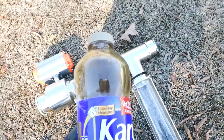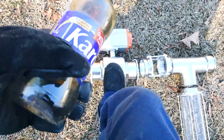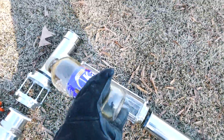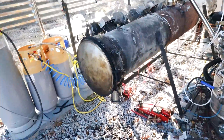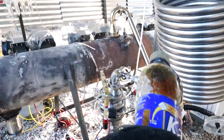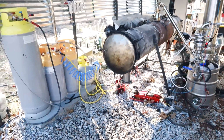Once there's no more air in that top section, we open the lower valve — which connects to the chamber — while keeping the vacuum port closed so no air is sucked in. The auger blades turn back on and all the shredded plastic falls down into the machine, keeping it airtight and under vacuum. The machine handles contamination and dirt — though pure plastic is better for variable control — because the microwaves don't discriminate.